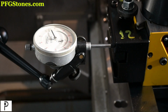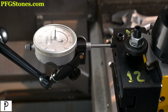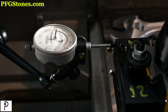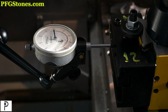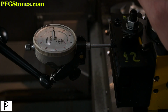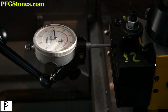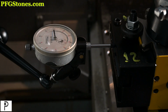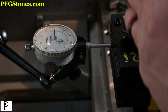So that's minus four, plus two. So that's 6 thousandths across those inches. Probably fine. And it is turned, so it's up against one of the pins. So once again, let's do the last thing we did before, which is just see where the play is coming from.